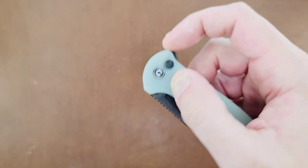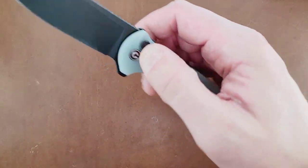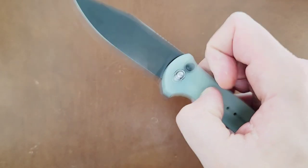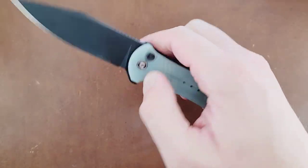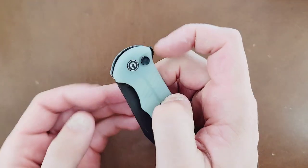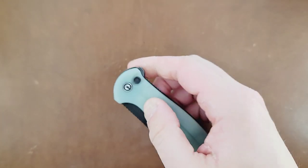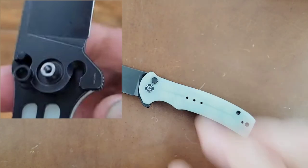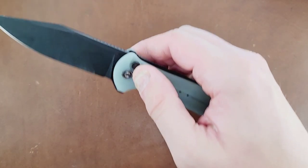The action on this is very interesting. The detent on this is tuned so well for being their first go at a button lock detent — or the lack thereof. It doesn't really have a traditional detent. It's actually the button mechanism that releases based on force. Just like how a detent ball goes in the side and pops open after a certain amount of pressure, this one is basically a little circular cup that holds it in, and after a certain amount of pressure it releases. Same concept, totally different execution, and they definitely executed it really well.